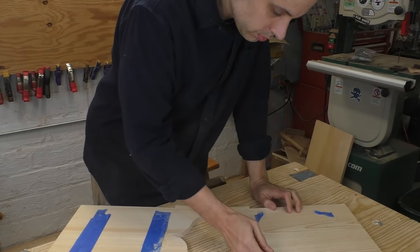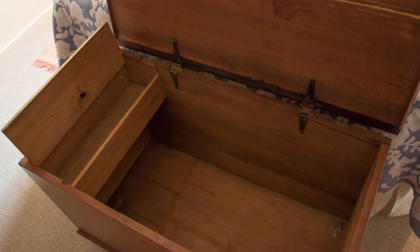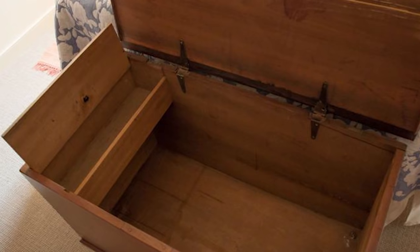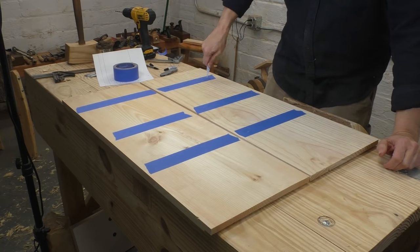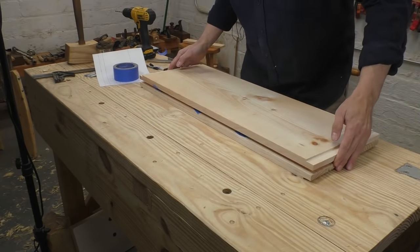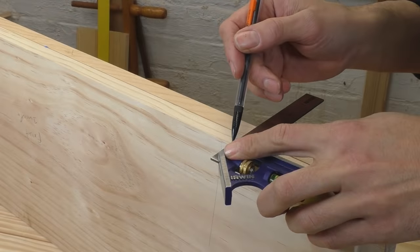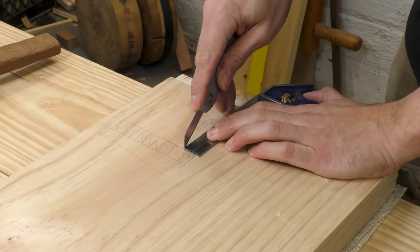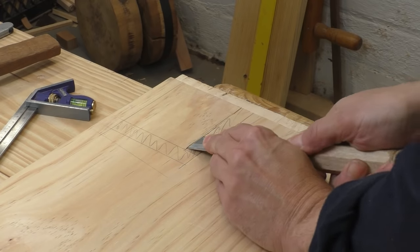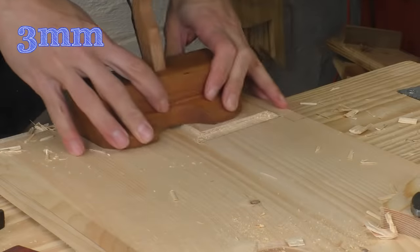But there's one more little detail I want to add. A lot of old chests have this extra part called a till — it's just a little box built into one end of the chest. Not only does it give you extra storage for little things like needles and thread, the lid of the till can also be used to brace the whole chest open. It's a brilliant little addition. The pieces of the till are held in shallow grooves in the front and back, and these need to be exactly parallel for the till to come out straight. So I'm going to use my tape and glue trick again. Once I get the layout done on one side, it's easy to wrap it around the edge and duplicate it on the other side. After the layout is done, I'm just cutting shorter versions of the joints we've already made — the grooves only need to be about an eighth of an inch deep.